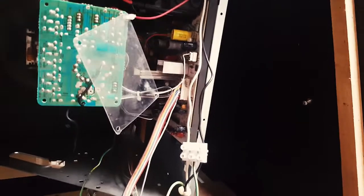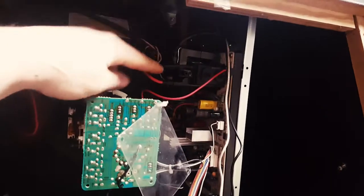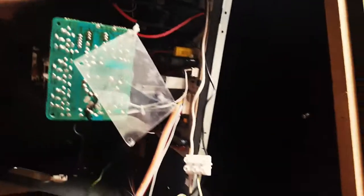Then you have your monitor — this is a Wells Gardner K7300. I have a video where I changed the flyback; this is a flyback here that was dodgy, there was a bit of high voltage leaking out of it. I've changed all that now. This is the neck board — it has the adjustments for the RGB signal. Typically what goes wrong with these is the flyback or the caps. I recapped it; I don't think any of the caps looked bad and I haven't had any problems since I changed it.